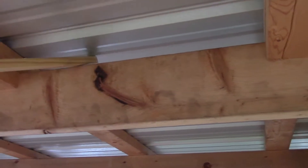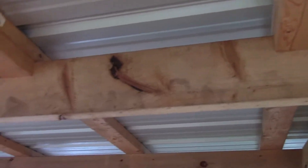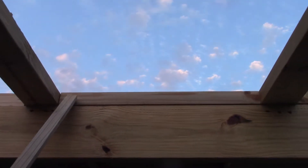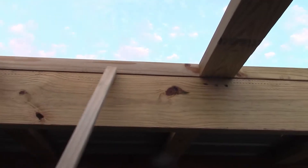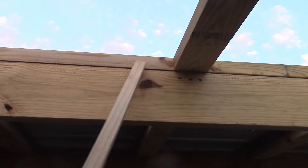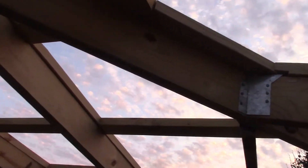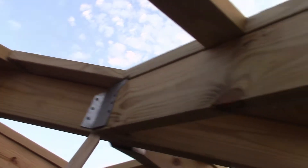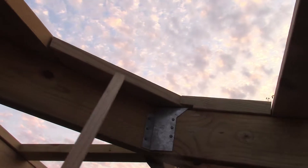With steel tin, this gap is perfectly okay, but in our shed roof today I went ahead and filled those gaps in. Here you can see what I'm talking about — right on that rafter, between the purlins, I've got this spacer, and I've got a spacer on the hip rafter also. You can see it right there.